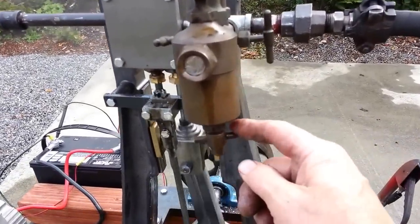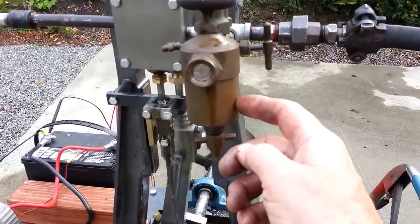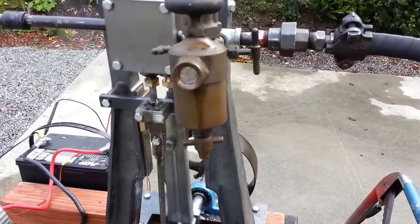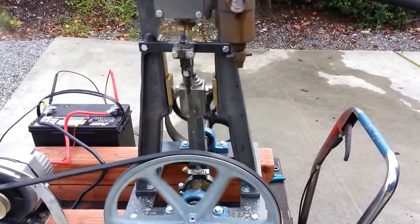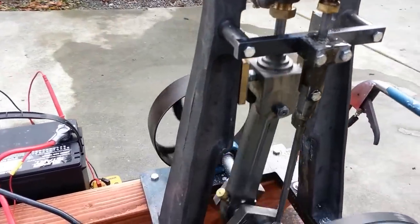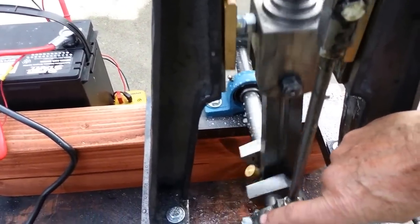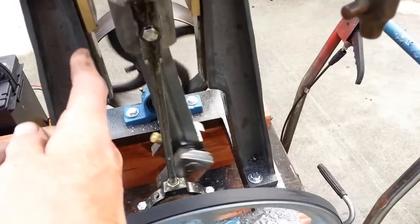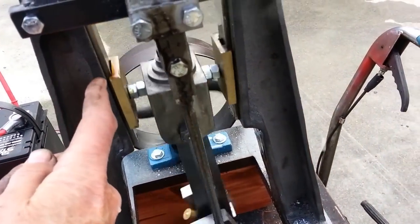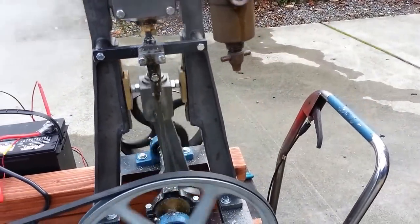This is the drain — because water will build up inside the tank here. You want to make sure you drain that out so it doesn't freeze. There are other oil points too, like right here on the eccentrics. Oil points there, and then these oil points up in here — the brass part moving up and down, the crosshead guides — need oiling occasionally.